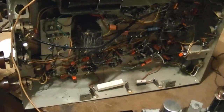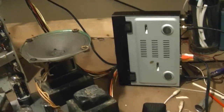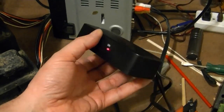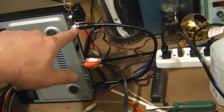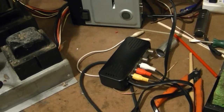Channel 6 sounds fine. That got me thinking about my source. So far I've only been testing with two things: the over-the-air pseudo TV station on channel 6 and this converter box. So I pulled out this little rinky-dink RF modulator that takes composite inputs and left and right stereo, and outputs on channel 3 or 4. My converter box has composite outputs, so I'm feeding that into this RF modulator and switching the cable feeding the TV.